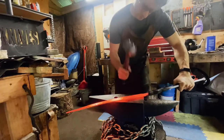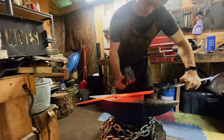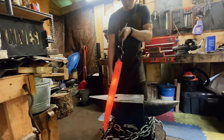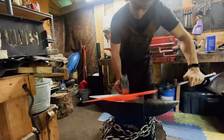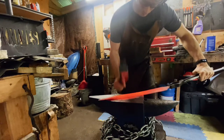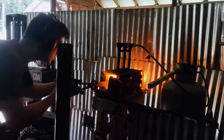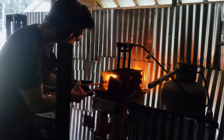This is a delicate process because once it is quenched, that's it — there's no more shaping of the blade other than fine-tuning on the grinder. So this is a lot of careful, delicate work that has to be done, in particular so that we can move it into the normalization phase.